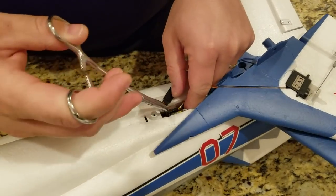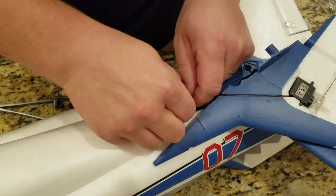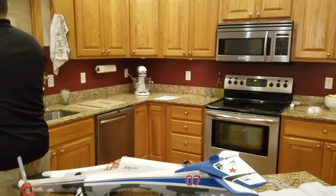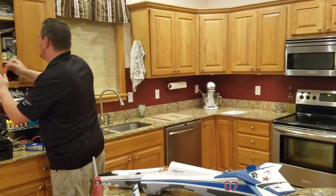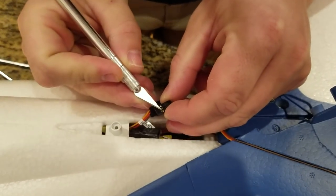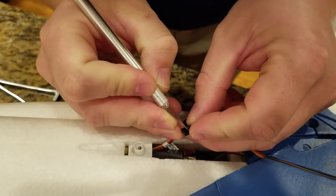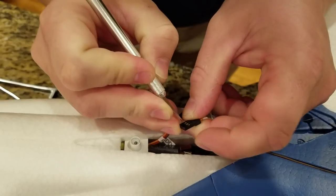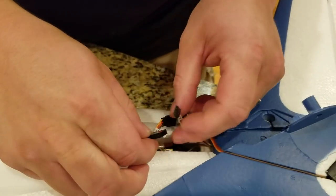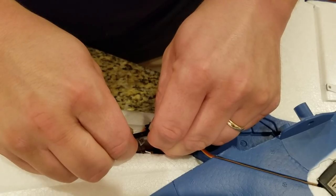They both came unplugged - I'm very surprised. These connectors are really slick and just not wanting to take the glue. If you ever get a connector that's working poorly, there's a trick with an exacto knife. See this little tab? You can take this tab and pull up or push down depending on whether you're tightening or loosening. I'll push down on that, that, and that. Now it feels like we're getting pretty good purchase.